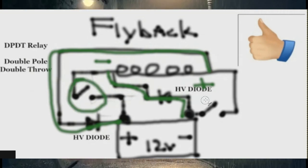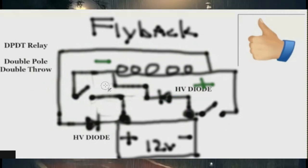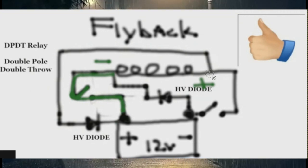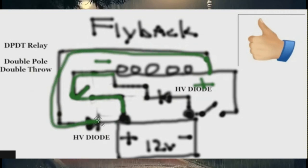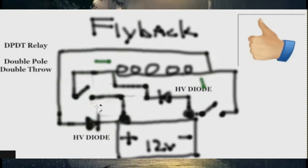When it flies back, the minus goes one way and the plus goes the other. The concern was: are these two switches going to open fast enough to prevent, for example, the minus flyback from reaching over to the other side? If it does, the plus flyback will cancel the flyback by reaching over here. This will cancel the flyback if one of the two switches on the double pole double throw relay is not opening fast enough.